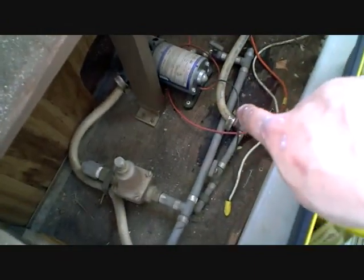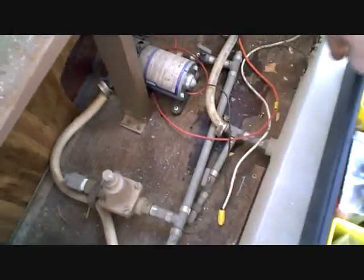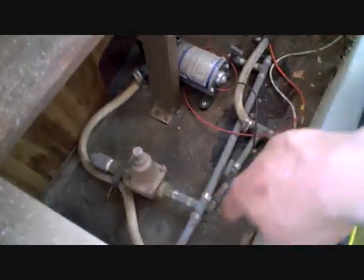Gonna enter a hole there. I'm gonna fish it through the outside through here. Bam, we're going to pop out here. I'm going to snip it a little extra just so I don't run short. And then we're going to tie into all this and then run more PEX from that side, coming to the kitchen sink and the bathroom.